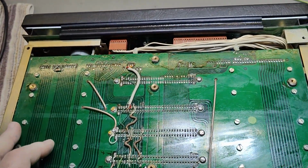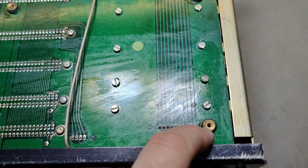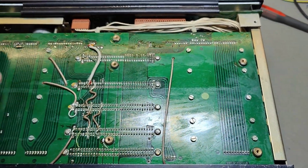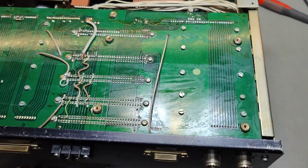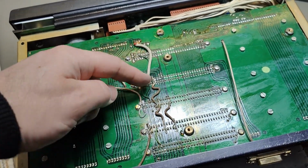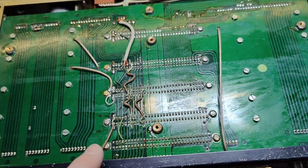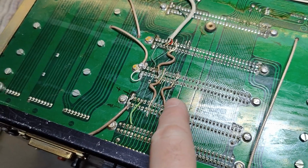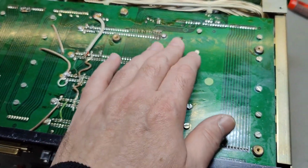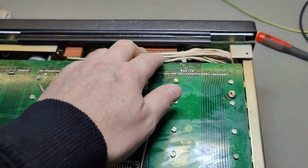And here's the motherboard at the bottom of the unit. It looks like with these little brass parts here, I would assume we are missing a bottom shielded plate that will completely shield and lock in everything in here. Because remember, originally all the RF tracks, they were just in those nice tracks, but somebody here improved it by adding little coax cables between the different modules. Quite a lot of modifications, right? I really can't wait to show you the front module.